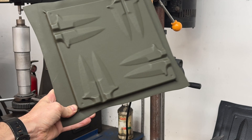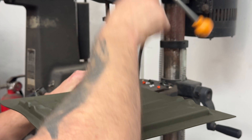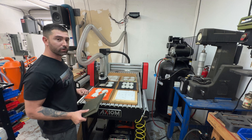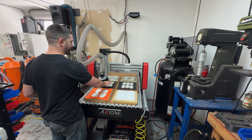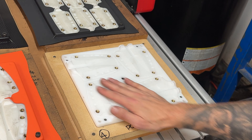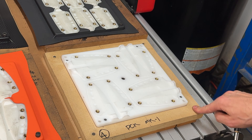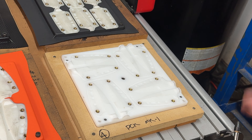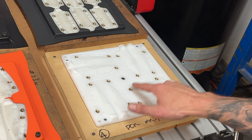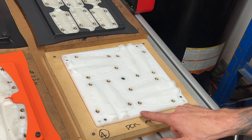In order to mount this on my router, I need to drill out the dimple holes in the corners — everything just self-aligns. I'm going to be cutting these out on my Axiom Precision router. I like these because they can store multiple work coordinate systems, so every one of these cutting fixtures has its own work coordinate system saved. I never need to reset my zero — I just turn this thing on and it's ready to run. The cutting fixtures are all mounted to what I call a location board, and on these location boards there are standardized outer pin holes, so this will pull up and swap with any other location boards and maintain its zero. I have threaded inserts in the corners so I can mount the sheets down before cutting the profile out.